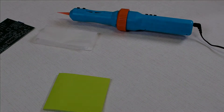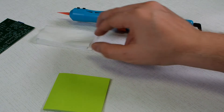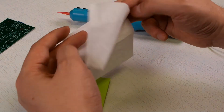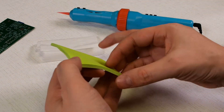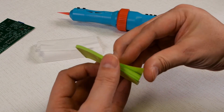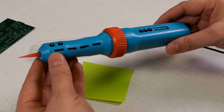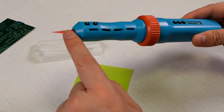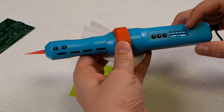In this video you will see how to set up iExtruder for solder paste dispensing. You will need a piece of paper napkin to clean the excess of solder paste from the dispensing needle, and a few Post-it type stickers for solder paste dispense trials. Please note that with solder paste you should use plastic dispensing needles. You can use red, pink, and blue needles depending on the pad size.